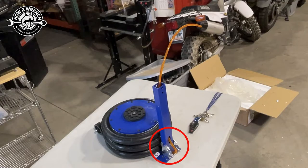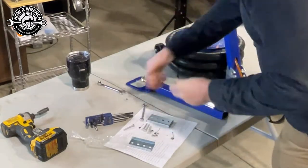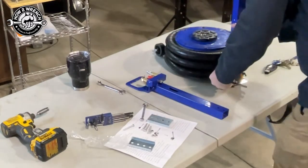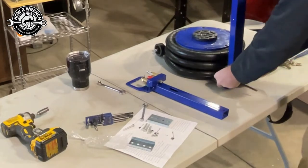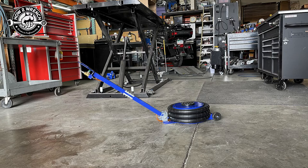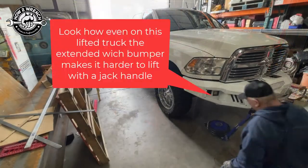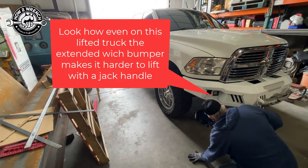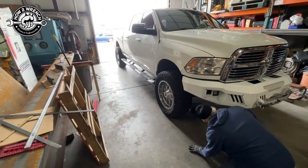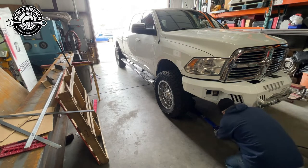Put the bottom part of the handle on, make sure the hole is facing backwards, and slip the hose up inside it. It's just a simple bolt and lock nut — don't over-tighten it, because you need it to float inside that bracket. This allows easy operation: the handle can be straight up and down for storing, at a 45-degree angle which is common for pushing it underneath vehicles, or all the way flat to really slide it under a tight area — that's why you want that bolt not to be pinched.